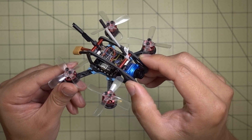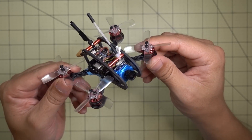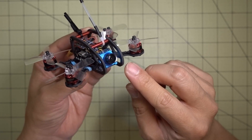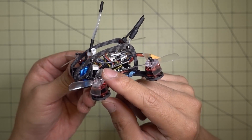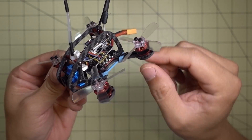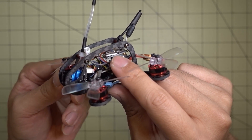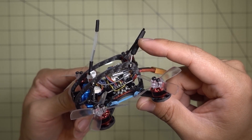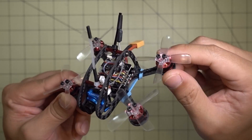I think these were being discounted — I bought this for about 20 bucks off the FlexRC site, just wanted to check out the frame because I've heard some good things about it. I mostly wanted to use these micro CCD cameras, and I've put the micro Arrow in here and it fits perfectly. The stack is a little bit exposed because you've got the two side plates and the sides are a little open, but I did crash a couple times and didn't have any major issues. I just foam-taped the receiver and the video transmitter to the top and it held up in a crash.